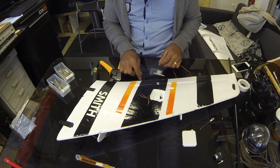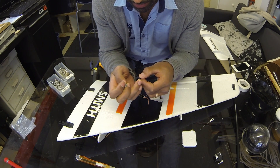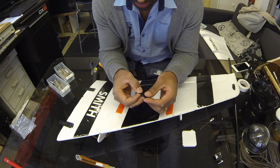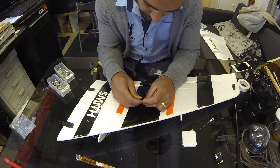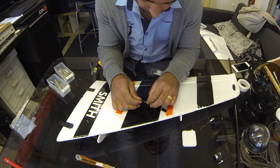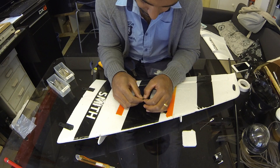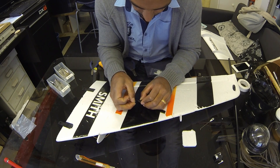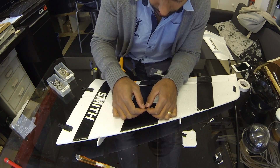So that's the connectors crimped on there. If you look at these connectors, you'll see a cutout — that's where the signal pin goes, the yellow one. So we need to make sure that when we connect this connector, that's going to be the yellow one. So we'll put that in there. These tabs here, they just click. The red one always goes in the middle. And then the brown one goes here. Then we just press down with our nail to press all those tabs into place, and that should be secure.